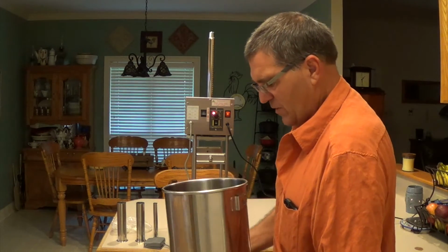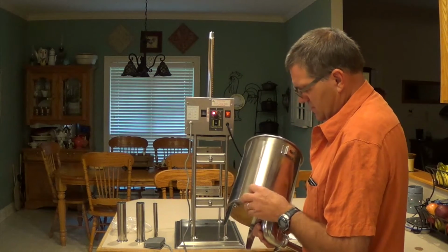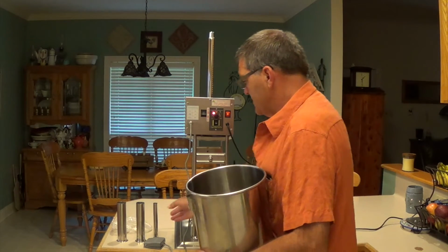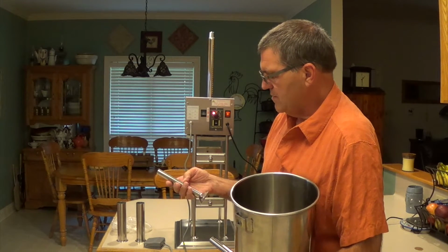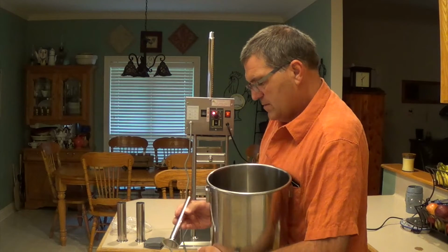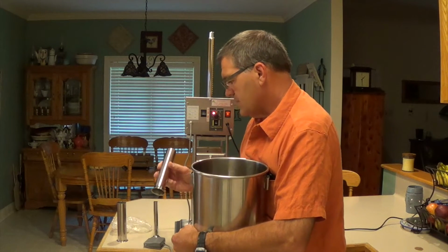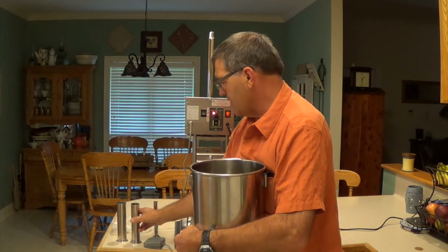Grinding on stainless or welding it can cause it to attract a magnet. One more thing. Oh yeah, the tube's the same thing. Even the smallest tube has a seam in it. You only see the seam on the inside, but not the outside. The 2 smaller tubes are welded to the little funnel. The bigger ones are 1 piece, but still with a seam in them. That's not going to be a problem.